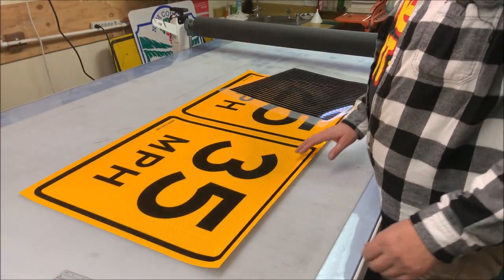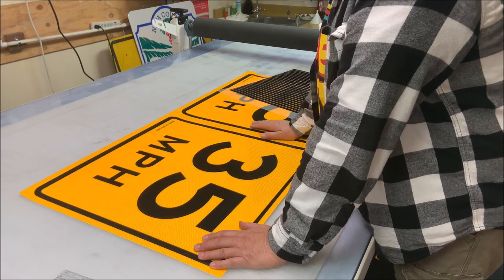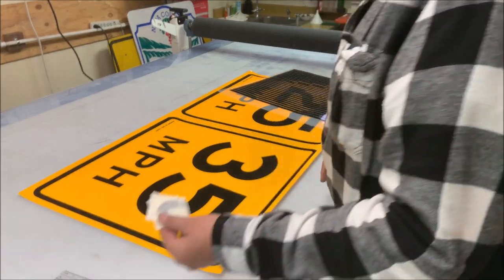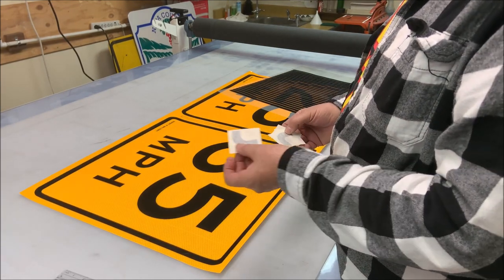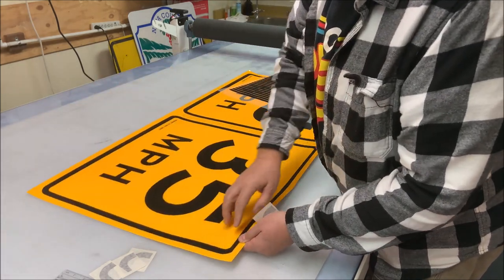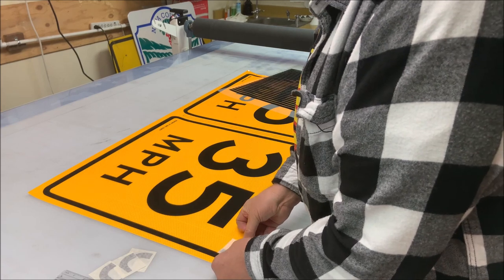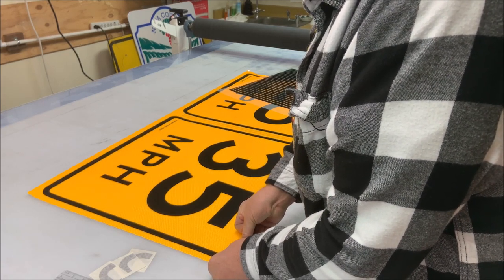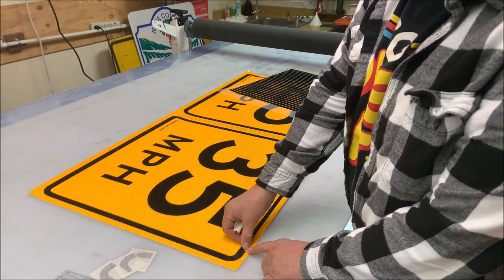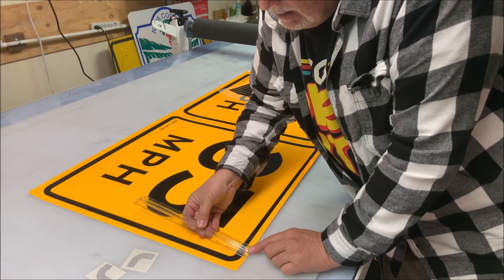Alright, I'll show you my quick little fix. So these were printed and I haven't put the ultraviolet sheeting on the top yet, which is a 3M product — I think it's called 1170C — and it'll protect these from fading because when you print with the printer they will fade. So I have some borders cut out. These are .625 for a 1.5 radius corner, which these are supposed to be. As you can see, the radius didn't turn out like it should. So what I do — I have these made up — I just peel one of these off and I'm going to line it up here; I can see through the transfer tape. Set it up on the corner. You can see how much that borderline was off. Now I got the full radius.